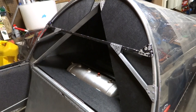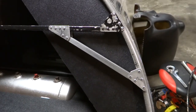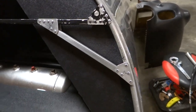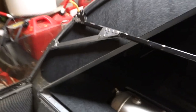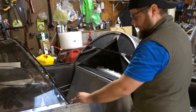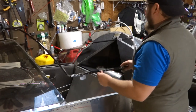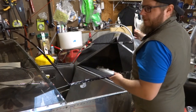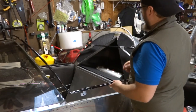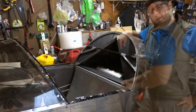As you can see I am reusing the standard plans canopy support, and I also added two of these additional supports. Locked it into place with some painter's tape, made some templates, cut them out with aluminum sheet I had sitting around, and riveted them into place. The canopy frame is so much more stable now — when I open and unlatch it, there's not much flexing at all. The hoop is not walking around, and in turn the front is not walking around either. It's a night and day difference adding these supports versus just having the standard support. Well worth the extra work.